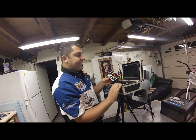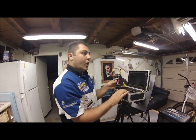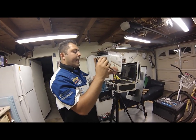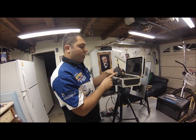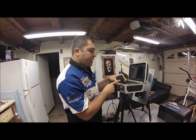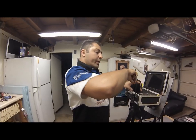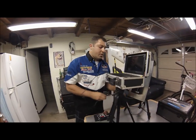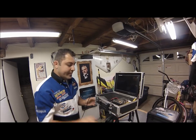Another note: with this 6600 milliamp power setup, with the batteries tightly packed like this, it keeps a nice compact size for our ground station and it also offers about an hour and a half of power for all of our components. I've got a 3 foot SMA extension which goes into our LOM8 video receiver at 1.2 GHz. ReadymadeRC also carries a really good 1.2 GHz receiver that has an upgraded saw filter. For my case, I use the LOM8 receiver because it doesn't have any interference with my Dragon Link. We go ahead and wire up the 3 foot extension right to our PepperBox antenna, which keeps things wired up nice and tight and close.